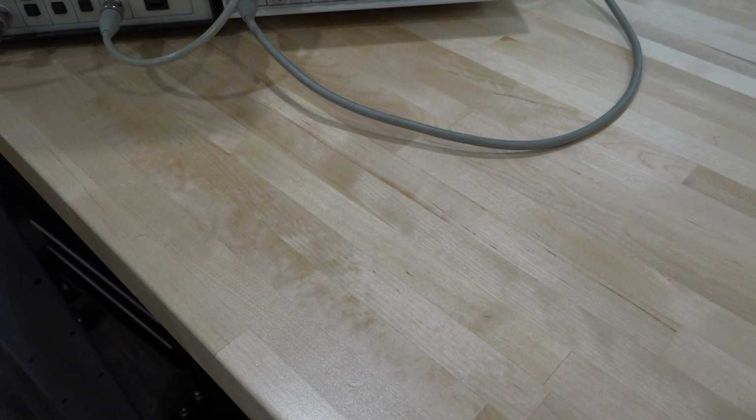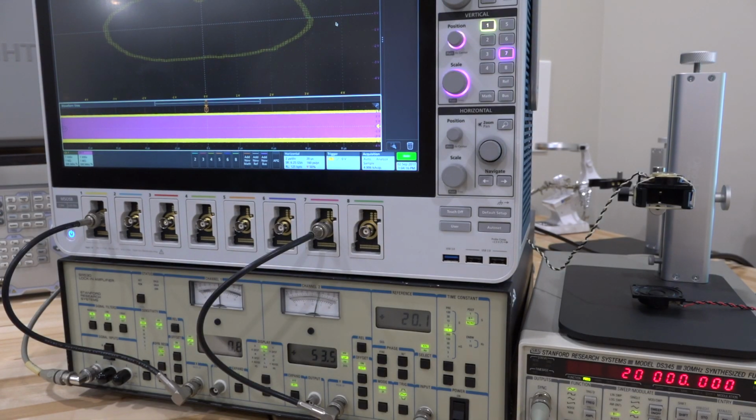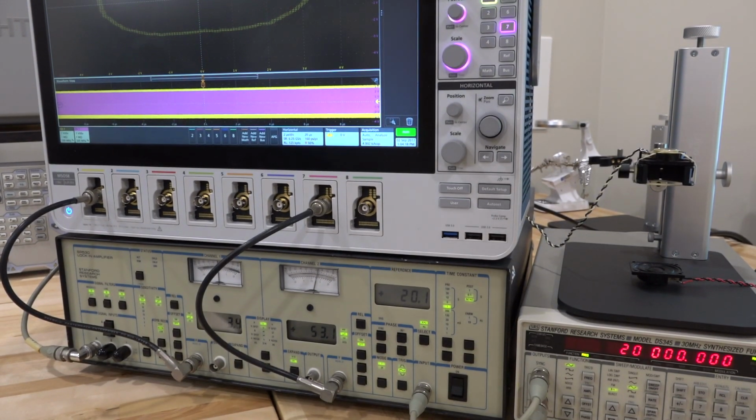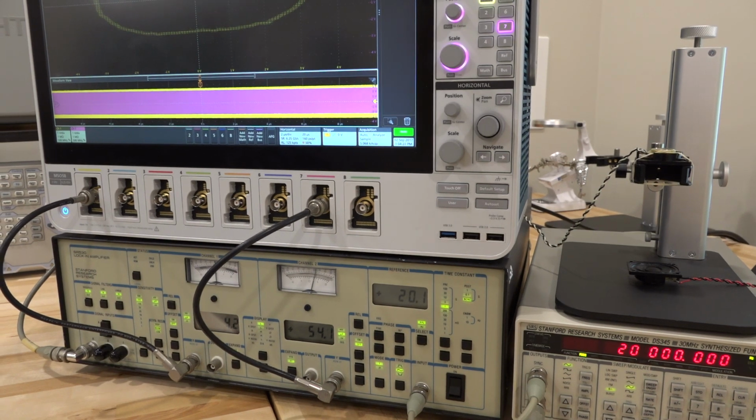I mean, all I did was set up a lock-in amplifier, 2 speakers, and some measurement to measure the values of those 2 signals, and when they became equal again, I took the difference in the distance. So in principle, it's a really simple measurement, and it of course demonstrates the phase measurement capability of any lock-in amplifier really, and having a 2-channel lock-in amplifier allows you to do this measurement. So I hope you like this one.